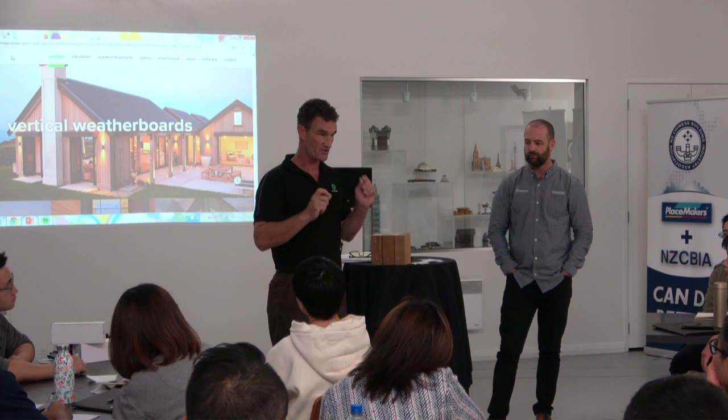Cedar, we can go to 40 as a colour, and then anything below that, down to maybe 35, we would need to have a conversation with you about the profile that you're using, the grain that you're using, and the paint system that you're using.